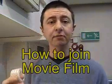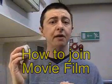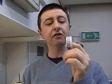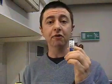When I first started in the projection room, this size of joining tape, which covers five perfs, was the type that was most commonly used. In fact, most people thought that if they used thinner joining tape, the film would fall apart after five or six weeks. Nowadays, this sort is most commonly used. This only covers three perfs of the film, but the film still does stay together, even on long runs of ten weeks or more.